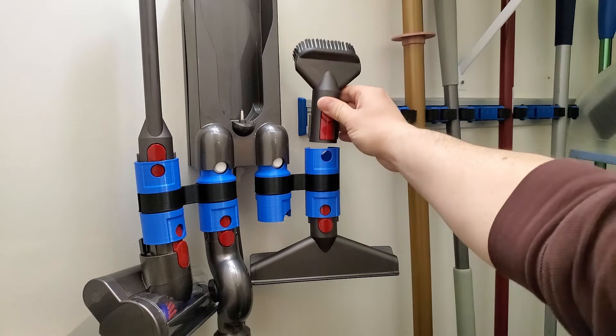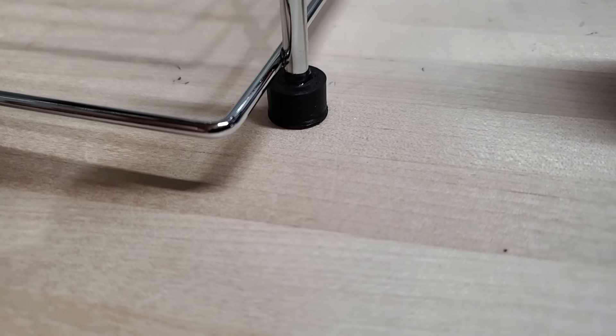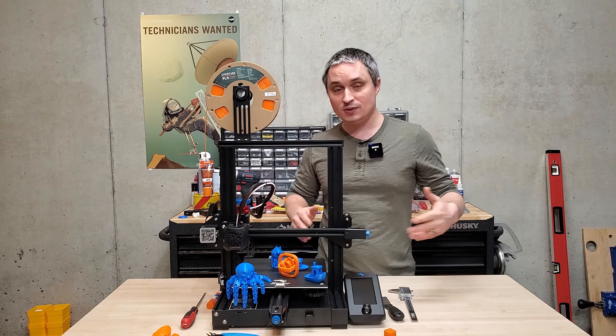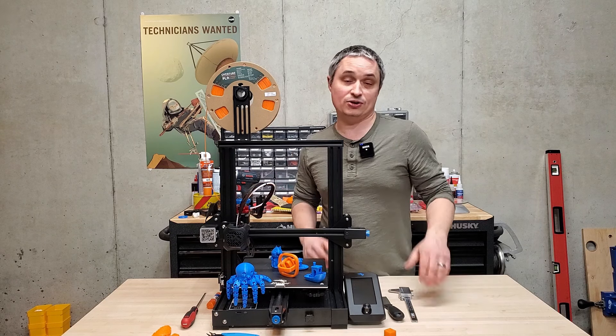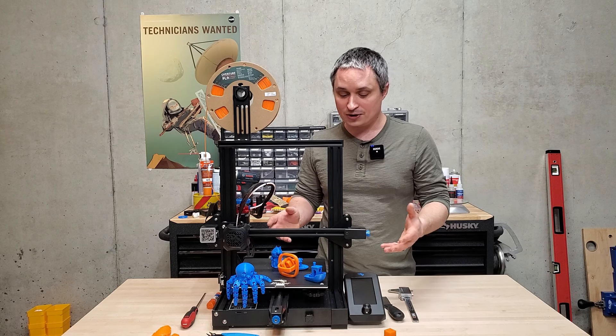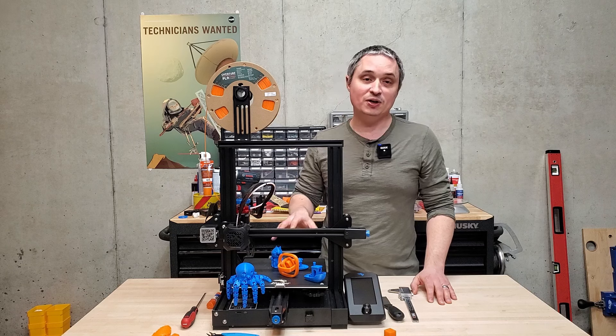It took about 20 hours to print everything, but I'm really happy with the results. This gives you a ton of flexibility — you don't have to go to the hardware store if you need a small plastic part. We had a puzzle rack with feet that were scratching up the cabinet because they were bare metal. Literally 10 minutes of work in Fusion 360 and I had little feet designed. 30 minutes later they were printed, and with five thousandths interference on the diameters for a nice press fit, they work perfectly. That's faster than I could go to the hardware store, even if I could find the right thing there.